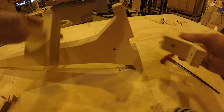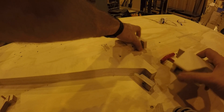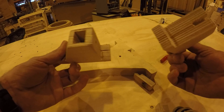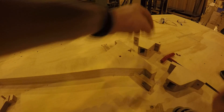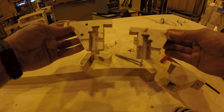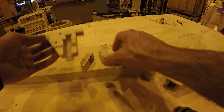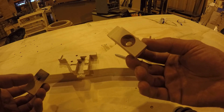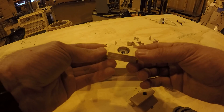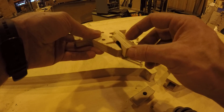What I've done here is re-engineered this a little bit. Looking at these two side pieces, I've split them into two pieces. There are little holes in the bottom, and the one on the right has a slot. I've come up with a clever system to bolt them together. These two little inserts — one has nothing in it, just a little L on the top, and the other has an embedded quarter-by-twenty T-nut — are both designed to go into these slots.